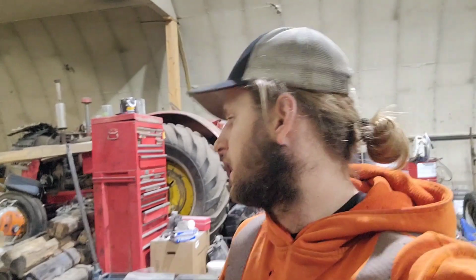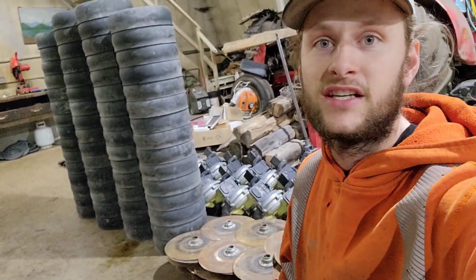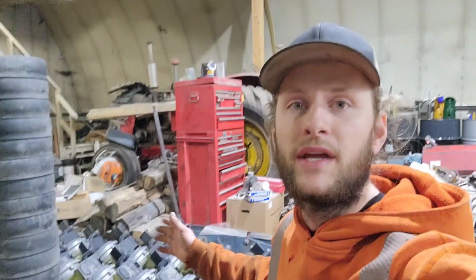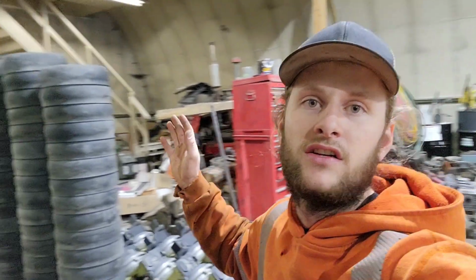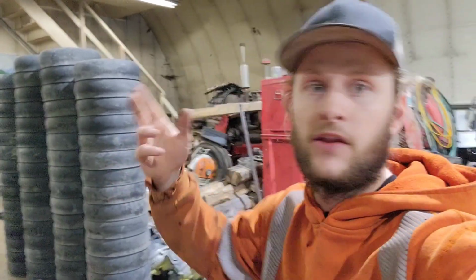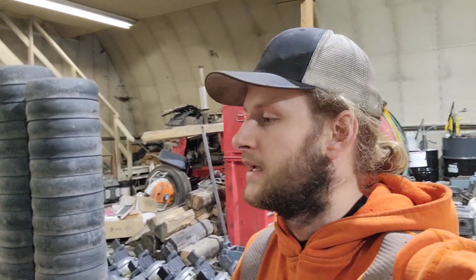Once I'm done taking all the seed tube guards off, then I'm going to spend the next 5 or 6 hours testing and measuring the opening blades and checking the gauge wheel bearings and doing all that. Then I can order parts. We know what we'll need. And then we'll start putting stuff together once I get those parts in. We'll probably end up ordering some from Shoop.